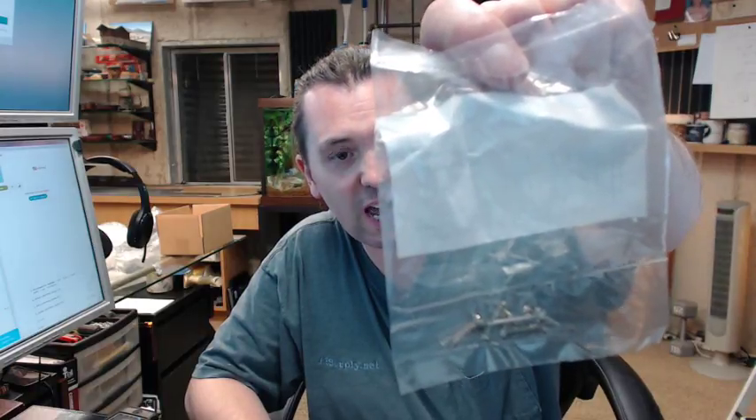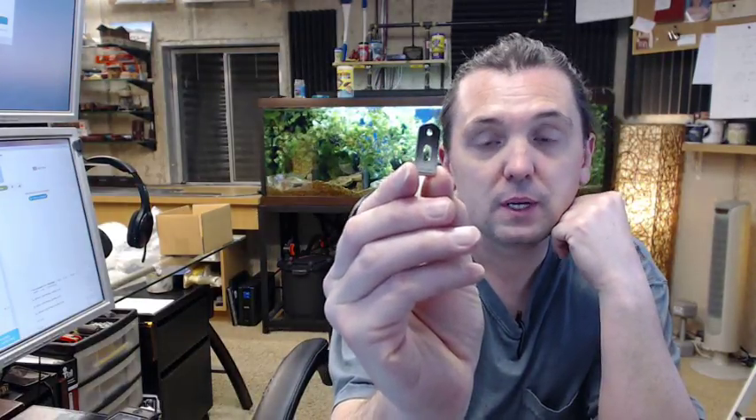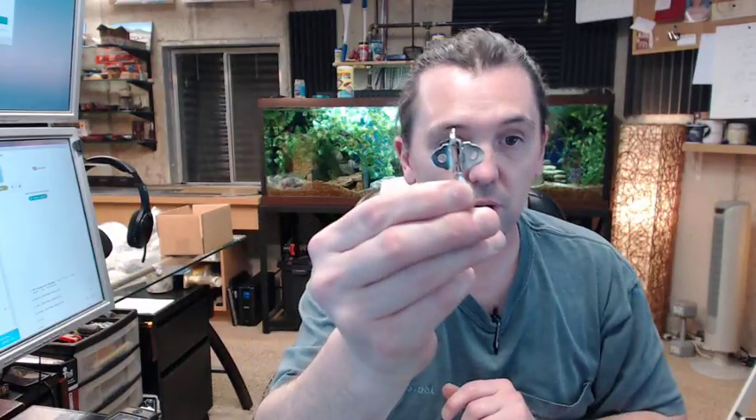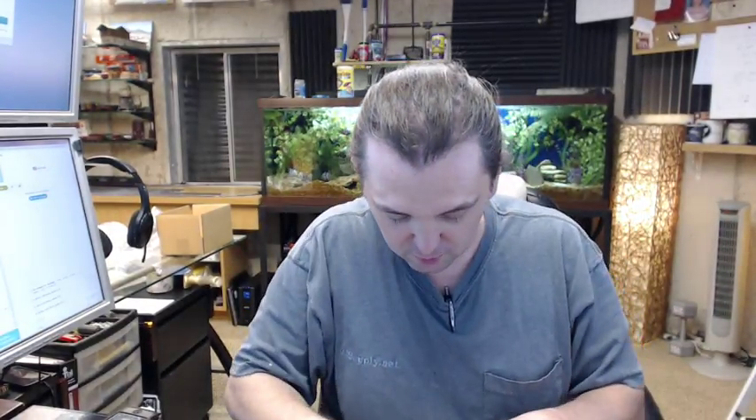You are also going to get a nail. The nails are to help with your installation in the sense that on the catch you have got a slotted hole. When installing, put this down first to where you are going to locate it on the cabinet, screw it down with the two screws, then because it is an unusual space to be working in, sometimes you are working a little bit blind. You can get that lined up close to where you need it, and you have got an oval hole that you can adjust it up and down for fine tuning. Then with the nail, put that through the hole above there and that will keep it in its permanent location — a very typical sort of installation.